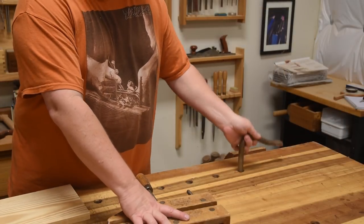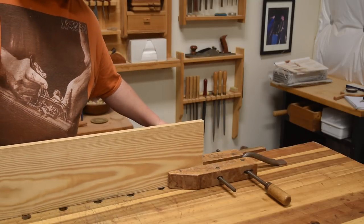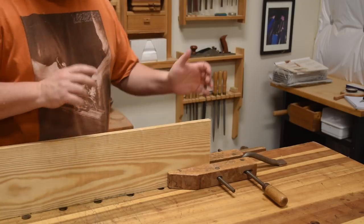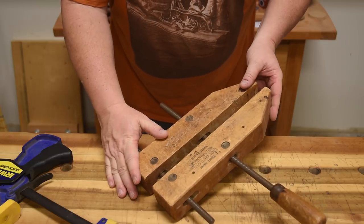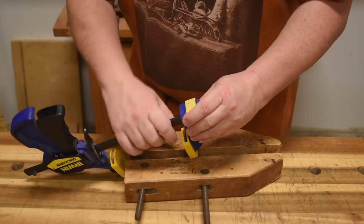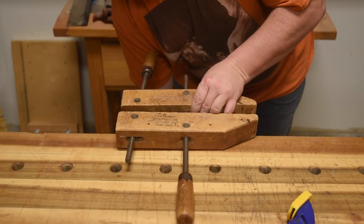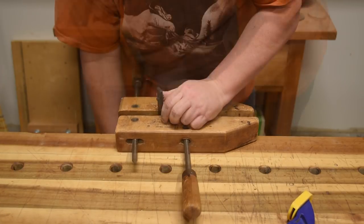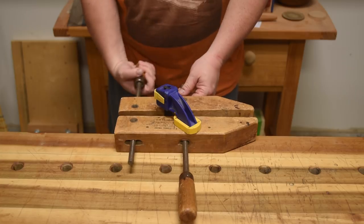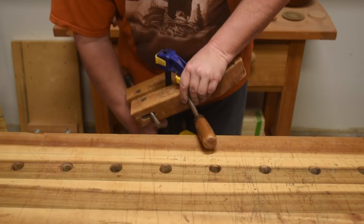Another trick I use a lot is to just drop some kind of peg in there — bump it up and let it sit in the jaws. That gives a little clamp and holds your work upright so you can plane easily. I mainly secure this with the hold fast nowadays, but I didn't start out that way. It's always good to get one of these quick clamps with a removable head, because you can slide it up underneath and reattach the head to clamp it right down and use it normally. It's nice to have no apron underneath your table — it just makes attaching things a lot easier.